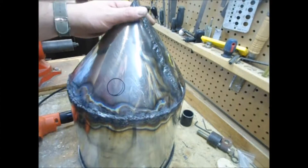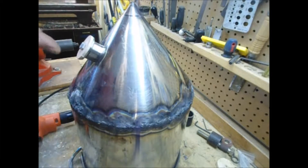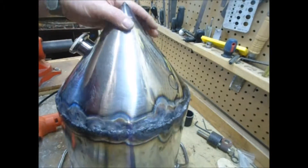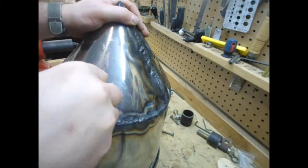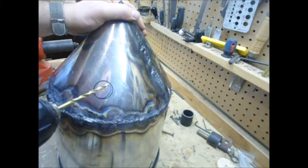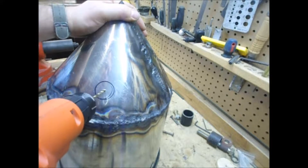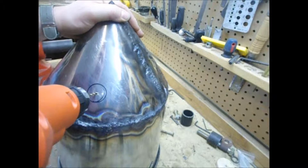So what we've got here — we want to start putting our triclamps in place, forming that center hole to mount them. We're going to center punch it first to establish a divot. We've got a 1⅛ inch drill bit just to start things off, and the hand drill.